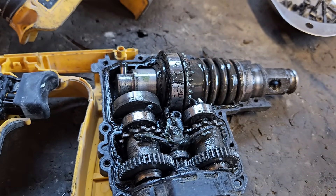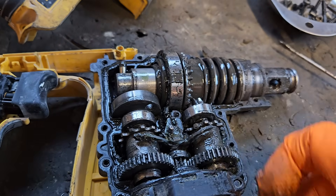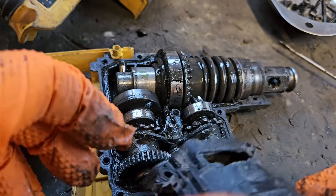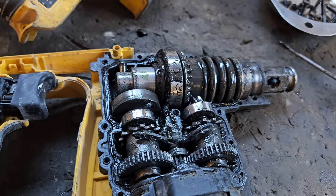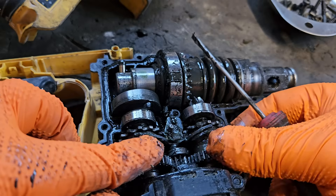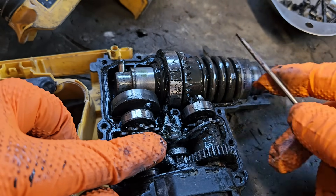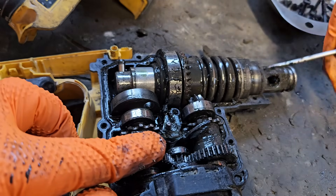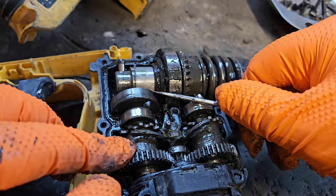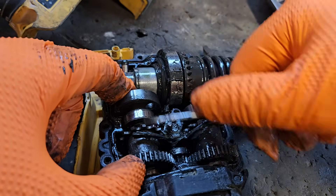I'm going to show you what's actually going on there. You can see the motor. We'll pull this off so you see. The motor drives these - that's fairly simple. And this is the one that rotates the drill. This makes the drill go round. And this one activates the hammer. This mechanism activates the hammer. And this is usually the one you need to deal with.